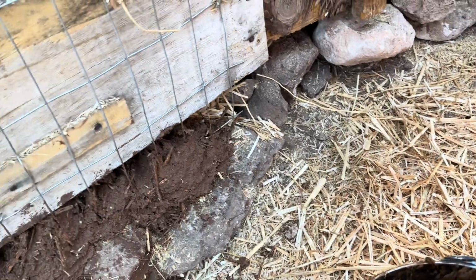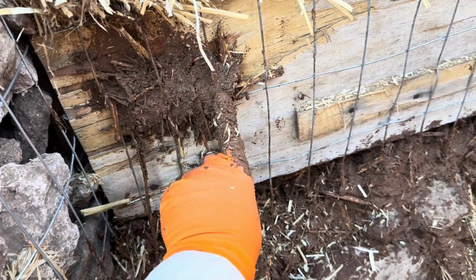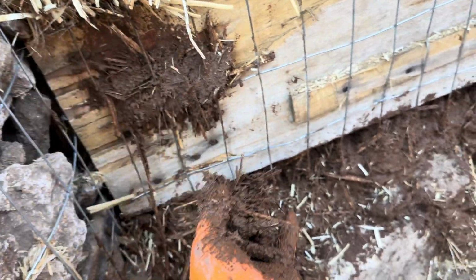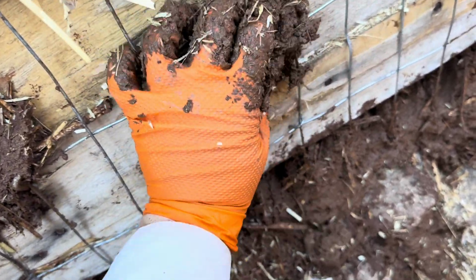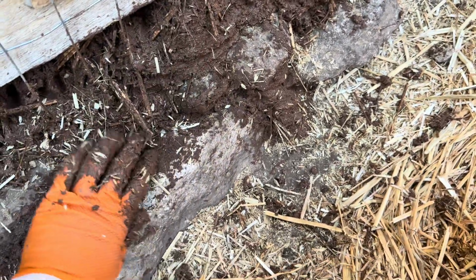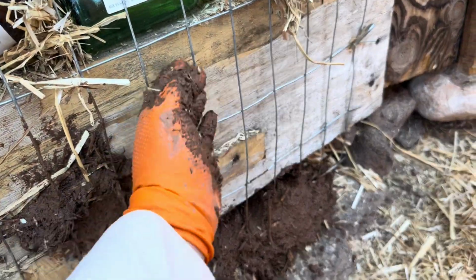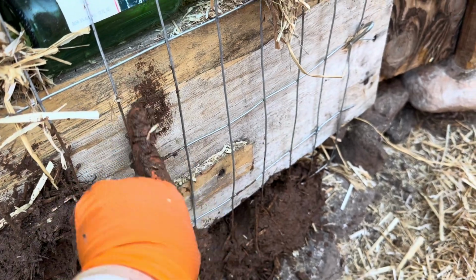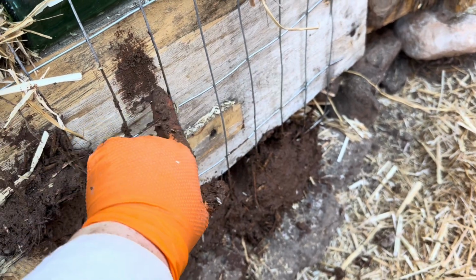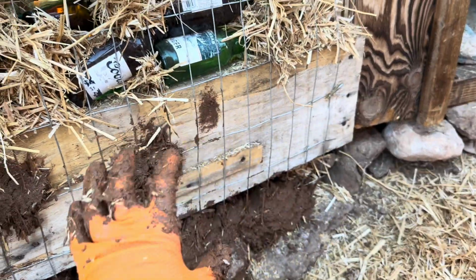So the next layer I put on with cob, as this starts to set up and dry through, probably 20-30 minutes, I can come on with another layer and build it out slowly. If it's more humid, it sometimes takes a little longer to dry, but we're in a pretty arid, dry climate up here in the high desert. Sometimes you can just put mud on the wall, like a clay slip on the wood part, and that gives you something to put mud on mud a little better.